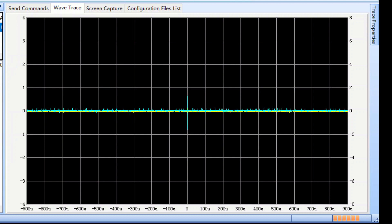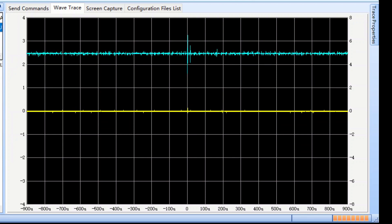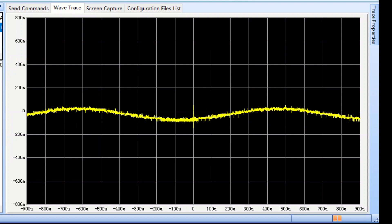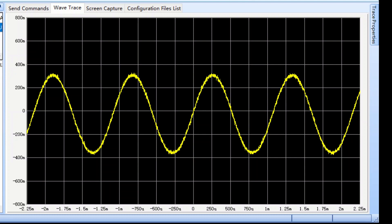So what I get now when I hold my finger on the button — there you go — proper square waves. At two volts per division that's five volts, going from five volts down to ground. We're now down at level four on the volume, which is quite low, and as you can see I've got almost no signal coming out. Let's hold the volume button and see what happens — there it is, up at a hundred. Let's wind it back down again.